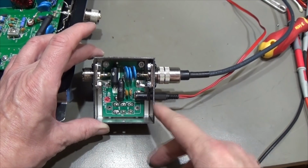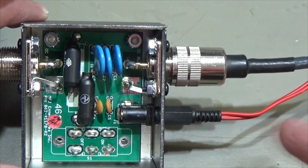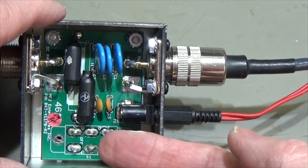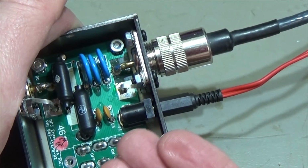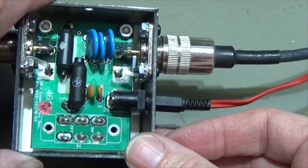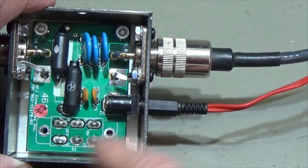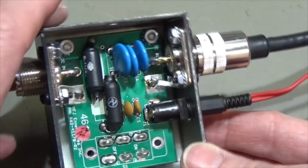I have modified the board here a little bit so that we do not have ground anymore here in any way from the switch, and I have isolated the switch from underneath so that it cannot get in contact with the PCB. Therefore, now it is lifted up a little bit, and that means that here our plug goes in a little bit stronger, but that is not really an issue. More important is that it is isolated here from ground, and that is given now. You see here the new components in, and you have seen it is now working just fine.